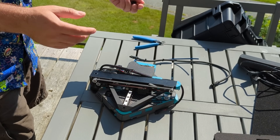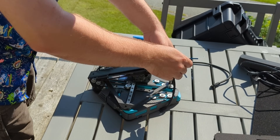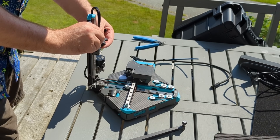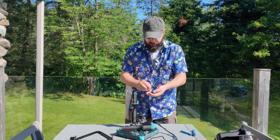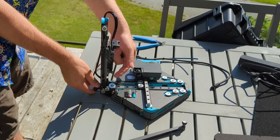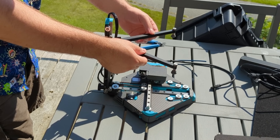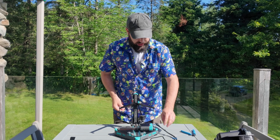To put this together, it's actually quite simple. You have two screws here, you take those both out, and you raise up the Z axis. As you're raising the Z axis, you may want to take out your bed holder. We can plug this cable in here — this provides power to the bed along with the thermistor connector. We take our big knob, screw that in the back here, and that will lock our Z vertically, keep everything aligned. Then we take our bed holder — you can see there's a bit of play there, and as you tighten that nut, everything becomes locked into place.